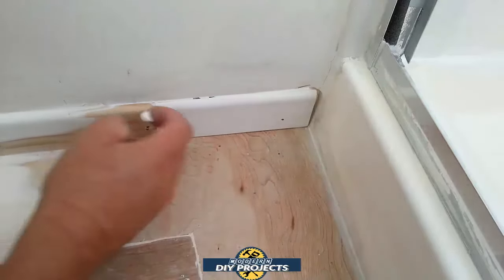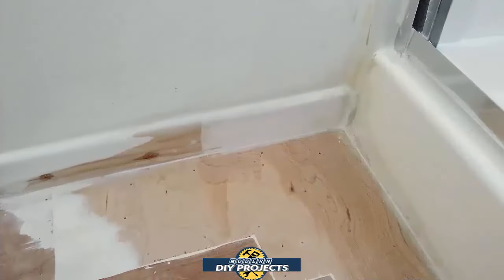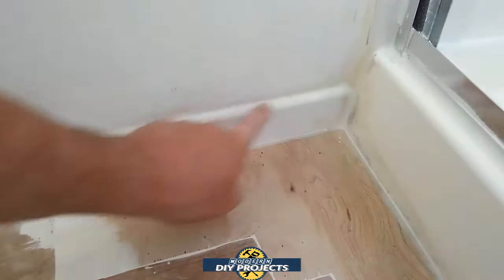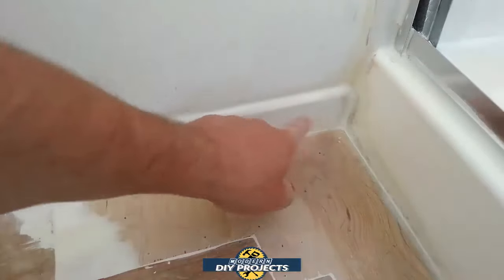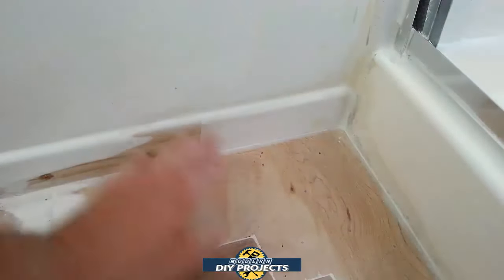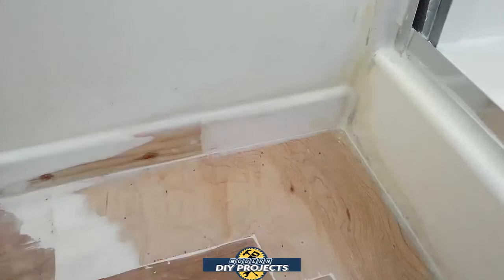We'll come back in a few days after all this has dried thoroughly and fill it in some more. A few days later, everything has dried up nicely. I applied a couple more layers of caulking to get everything nice and smooth across the top, sides, and bottom. I sanded off the molding and feathered it all out to make everything look nice and proper. Now we're going to go through and put some primer on there — everything's been filled in on that joint because you don't want to see a joint. Then we'll continue on to put some paint after the primer dries.